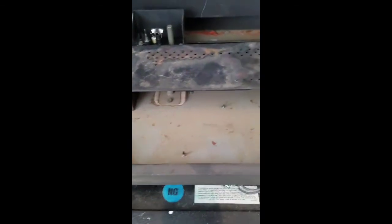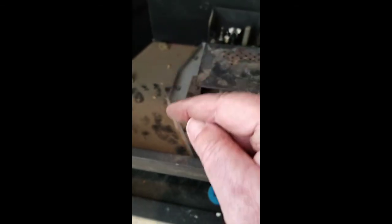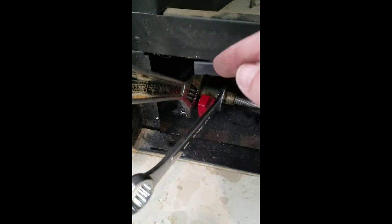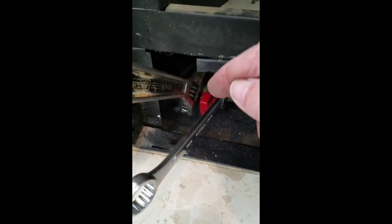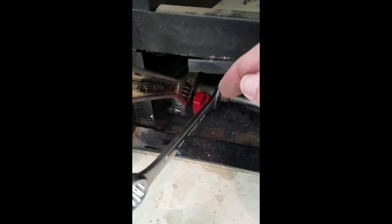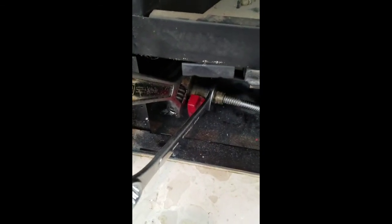Okay, the base plate assembly is back in. Careful about making sure that gasket is sealed all the way around. 13 screws. Reconnecting the final connection back to the inlet valve for the gas supply. Always make sure you hold back when you tighten this last fitting. Very important. Two wrenches.